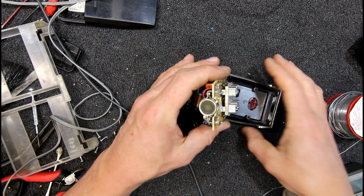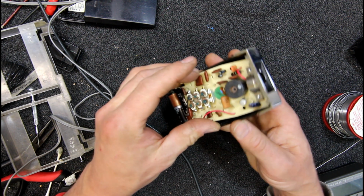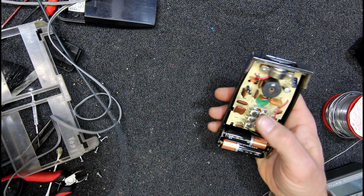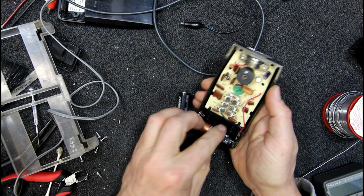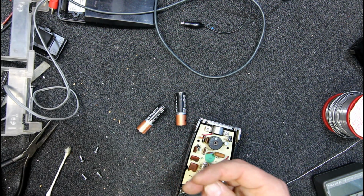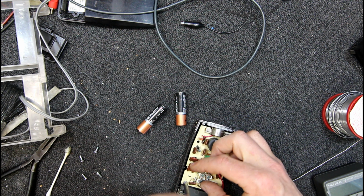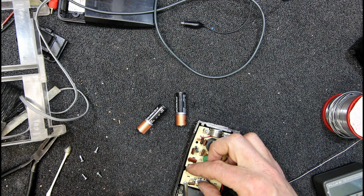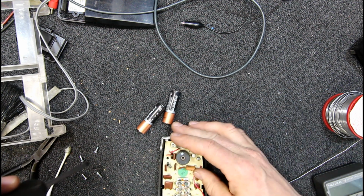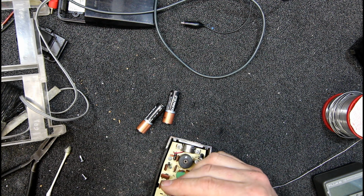I didn't realise they had a neon in them, or if I did see it once before, I'd forgotten about it. I think these were AWA ones. Were the only ones to actually have a light inside them, but I could be wrong. Don't think it was normal on the Ultrasonics to actually have any indication, which is a good feature to put on there so people have an idea if there's something up with their batteries or whatever, or the remote's been dropped one too many times. So kind of a good feature in a way for diagnostics by the customer. I reckon they probably chew through the batteries relatively quick, whereas infrared ones can go forever, just about the life of the appliance, without needing new batteries, unless the batteries just rot away from age.